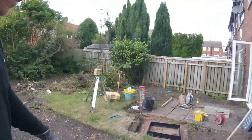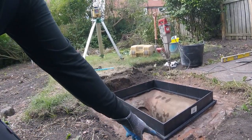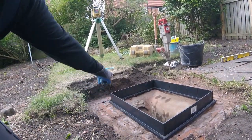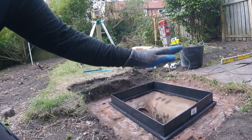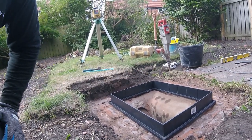This one's worked out perfect. As you can probably see there, I've got about 20mm of bed of cement to put around, and then I'm going to re-level it with the laser to make sure it's perfectly level to suit the path.